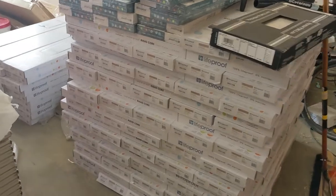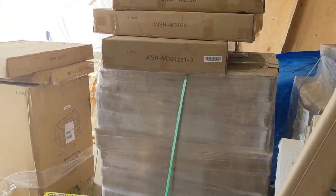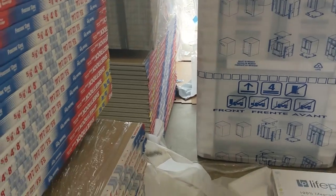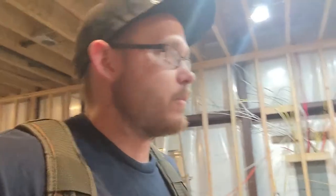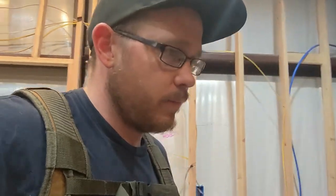We've got our flooring stacked up right here and our cabinets over there - just tons and tons of stuff to install. We need to get a move on this drywall. Now that we have our drywall, we have almost everything ordered that we need. I need to get some insulation for this back wall. We're going to actually double insulate all of the exterior walls - it's probably overkill, but I think it's going to be good for noise reduction. We live next to a wood mill, there's heavy equipment, and I don't want noise coming through. We have 5/8 drywall that we're putting up everywhere.